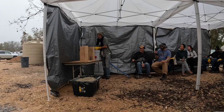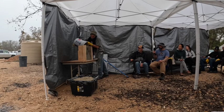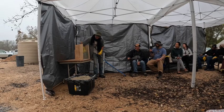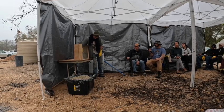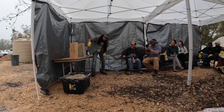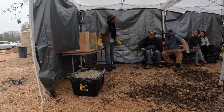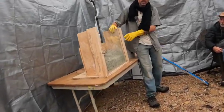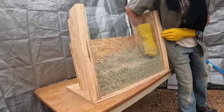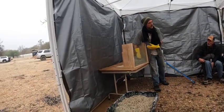A lot of the time, people come and bring their bucket and just whack it in there like this, and then they start tamping. You see down the bottom here, it's really not getting a lot of tamping. It's not getting compressed much at the bottom. There's a resistance that happens, so it isn't able to push down into these little spaces because you've got too much material.